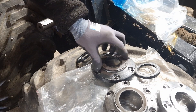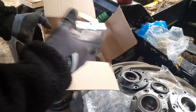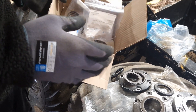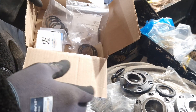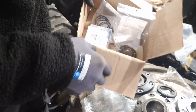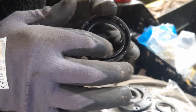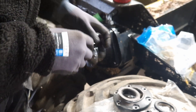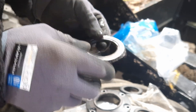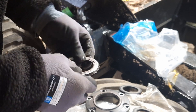So I pulled off the sprocket and saw that it had come apart. I have a bunch of seals here — they do have seal kits for the motors, like complete kits. Those are about 90 bucks a piece, and I'm not resealing the entire motor, so that's pointless. I just bought the seals individually, which was a bit harder to figure out. This one's pretty easy because it has numbers inside you can look up and order, but for the dust seal it was more complicated — it doesn't have any numbers so I had to go by measurements.